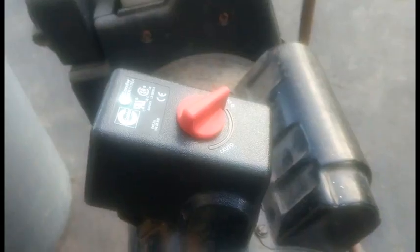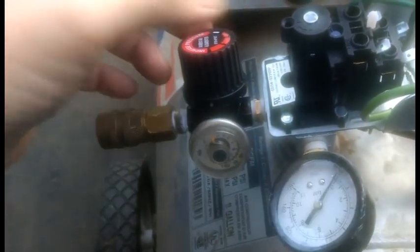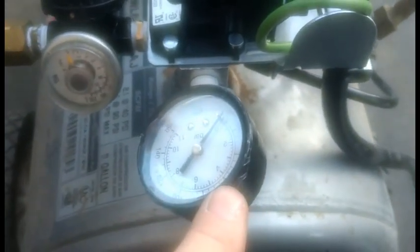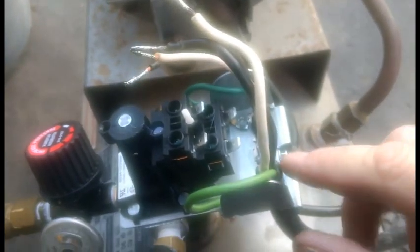Black on the top for power in, and one on the bottom for power out going to the motor. I've got it installed. My air pressure goes out here — here's my new regulator, the old gauge on it, and my new gauge which tells me how much air is in the tank. Don't forget to put your pressure relief valve on there. The green ground wires go into two screws — one there and one there — and you screw them in.